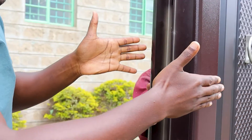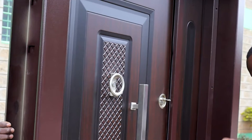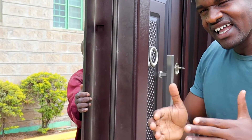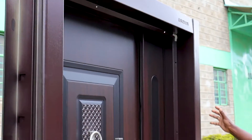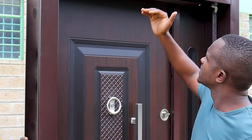This active frame affects your wall thickness. When the frame is completely retracted, it covers about 18 centimeters; when fully extended, it reaches 25 centimeters. So your wall must be between 18 and 25 centimeters thick. It's important that all sides are the same thickness — if you decide on 20 centimeters, it must be 20 centimeters on all sides. If 23 centimeters, then 23 centimeters on all sides, so the frame is well aligned and properly installed.